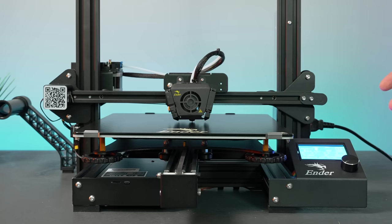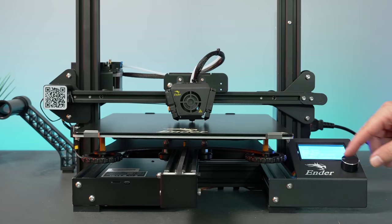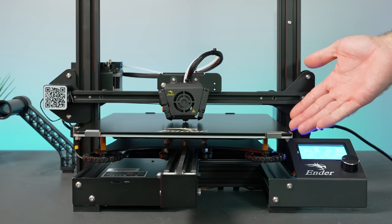I'm pretty happy with all four corners. Checking the center — feels about right, maybe a little loose. If you need to raise or lower the whole platform uniformly, turn each corner knob the same small amount. That should be good. It's not complicated — just take your time. Go back to Prepare, auto home, disable steppers, and recheck, since you may have bumped something during leveling. Everything's still the same, so we're good. A glass bed is pretty flat, so once you're close you'll be fine.